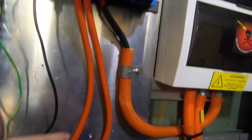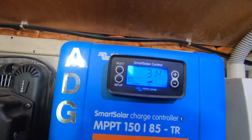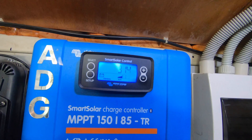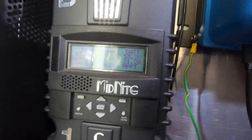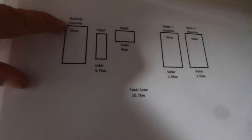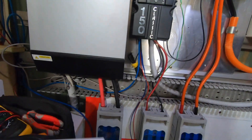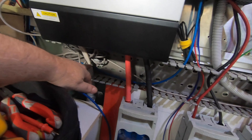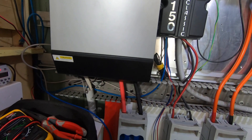We've gone to 16 millimeter squared on the input there, and 25 millimeter squared on the output. Currently at this time of day — roughly 8:30 in the morning — we're already putting in 31 amps on this one and 21 amps on that one. What we did was we took the solar off this unit here — this is our backup inverter — so all that's got on it now is the generator.